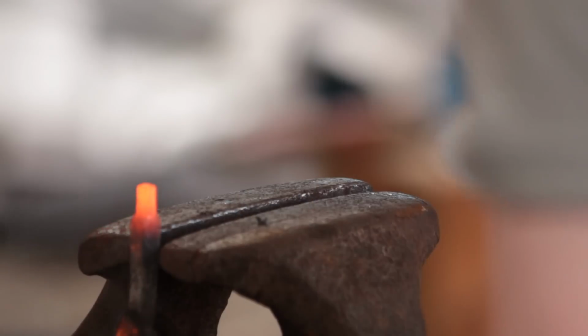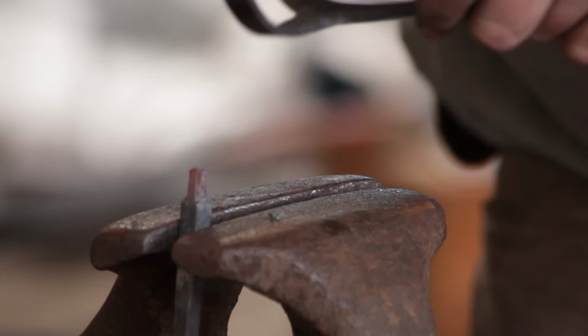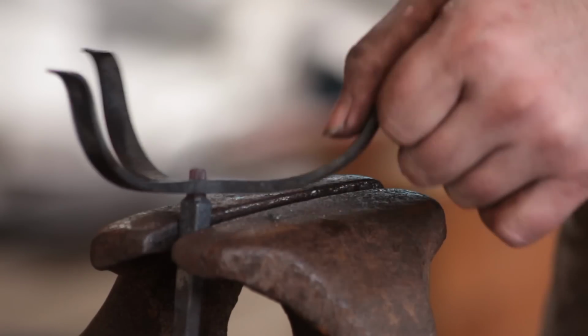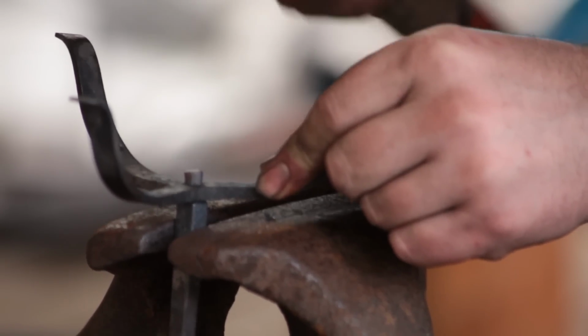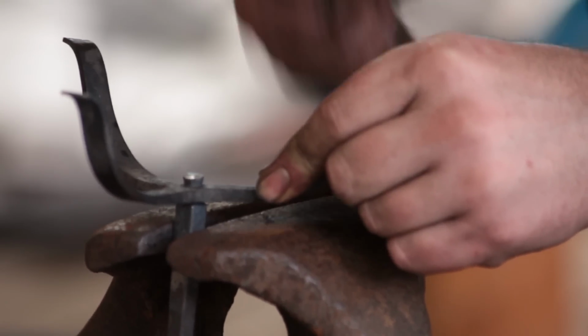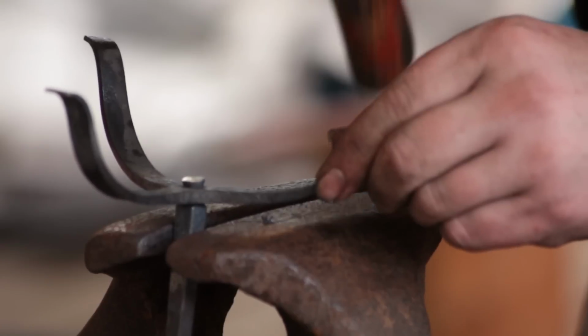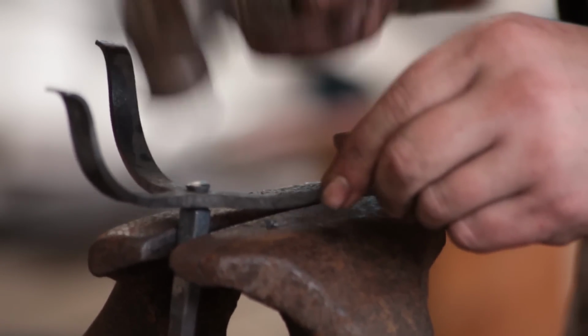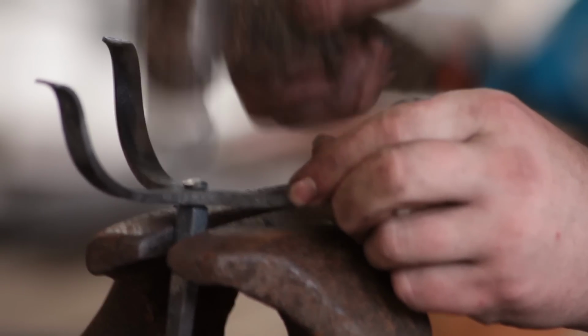So at this stage, heated up the tenon, and I will just drop the tripod on there, rotate it to where I want it, and start peening that tenon. Nice tight fit, but I didn't have to do any filing to it, which is a blessing. Filing tenons down is boring. Ideally I could have done with a gas torch for this. Would have made things a bit quicker, but still worked.